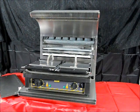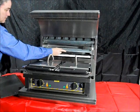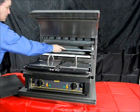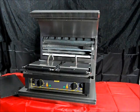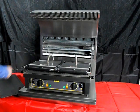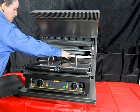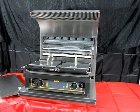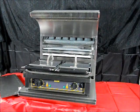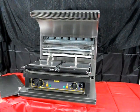Next, there is an electrostatically charged particulate filter. This filter cleans the smoke from the air. The filter can be rinsed and should be replaced every 4 to 6 months. And finally, there is a carbon filter, which cleans the odor from the air. This filter should be replaced every 4 to 6 months, depending on the application. The filters must be in place and the front panel installed for the SA-Vent to operate.